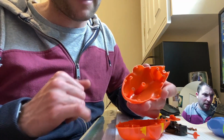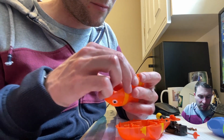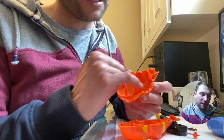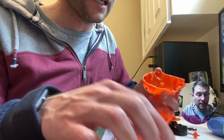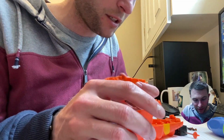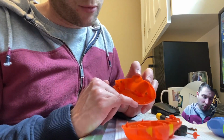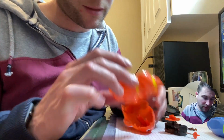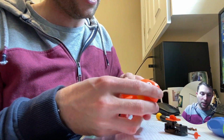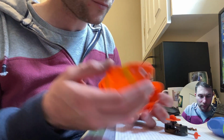This rib here is massive. Not very stable. Not got any ribs. Maybe look to improve that. They've got the same location pip detail as on the other part, so clearly that works quite well if it's been used on multiple products. Feed point there, it's been partially trimmed back. Feed point there. Similarly, the bosses have location features as well, male and female.